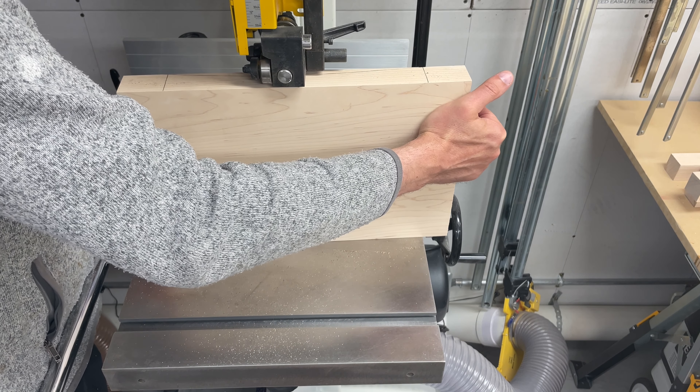Next up, I used a half-inch round over bit to put a nice big round over on all the edges. As you can see here, I screwed up a bit and cut way too deep on the top side. I wasn't really sure what to do so I just finished cutting it at this depth. More sanding and I was able to remove the hard edge the round over bit left and the profile I ended up with is pretty nice. I think a lot of this would have been easier if I had a hand plane to remove larger amounts of material, but I was able to get it done with the sander.